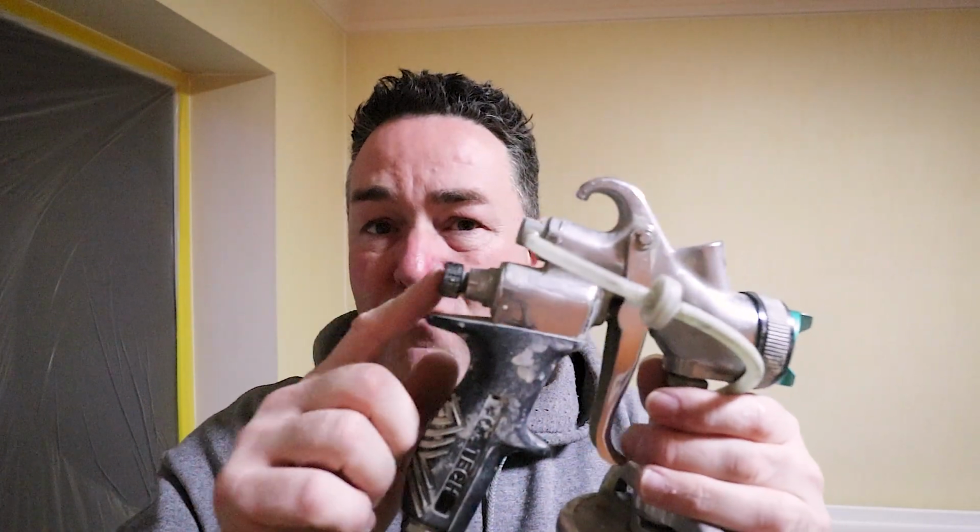So for this, I'm going to be around this room in 10 minutes, aren't I? I've got a 1.8 needle, which might be a little bit too big. If you want to know about HVLP spraying, it's there. But I've got a 1.5 and I've got a 1.8. Now this is the 1.8, which is the orifice size, so it will be a bit bigger, but I can regulate it by dialing it in at the back. If I want to reduce the flow of paint, I can screw it in. If I want to put a bit more paint on, I can screw it out. But I just need to get on today.